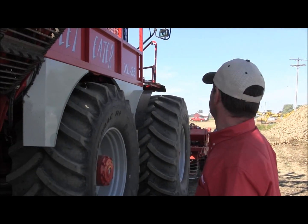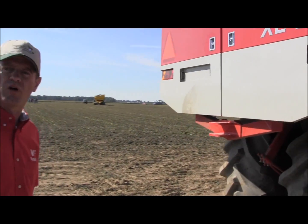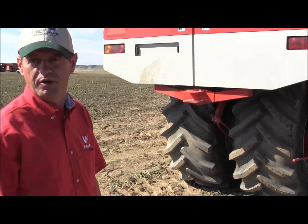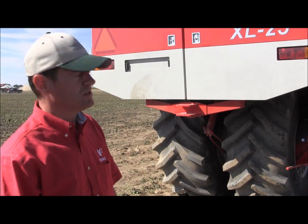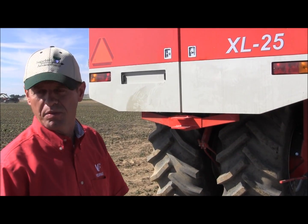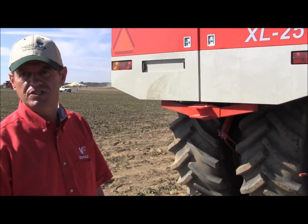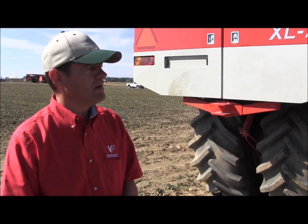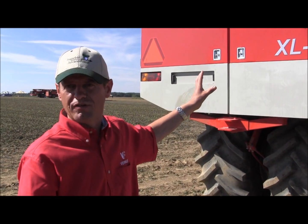How about engine and drive? The engine is similar to what's used in Kenworth trucks — it's from the PACCAR company. Kenworth and Peterbilt are PACCAR companies. We have an engine of 580 horsepower on this machine. The drivetrain is completely hydraulic, and we use hydraulics from Sauer Danfoss. All the settings — all the hydraulics — are controlled electrically from the cab. You can change all the settings and all the speeds. It's all Canbus nowadays, so if you move the machine faster, the whole machine speeds up and the cleaning speeds up. The engine runs at only 1200 RPM, which is very low, to keep fuel consumption as low as possible.